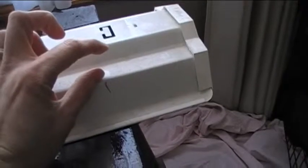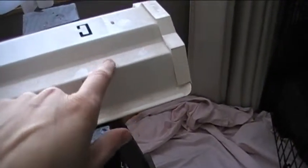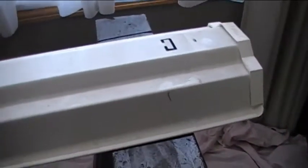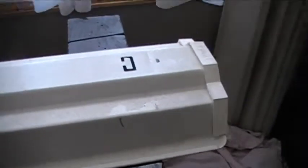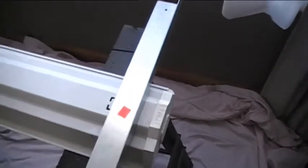And there's going to be a gap there between the metal that goes across and this. You'll see the screw that goes through. But I think it'll hold it just fine. It'll be good enough for the purpose. So that's what I'm going to do. Also, you need to obviously remove the bulbs from your lights before you do this. Otherwise, you'll be running your drill right into the bulb, and that's not a good idea. So what I'm going to start by doing is lining up this piece of metal on the center of this light and mark it and drill it and put the first bolts in.